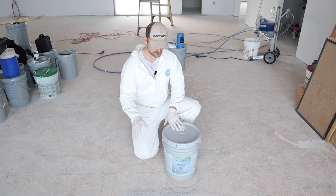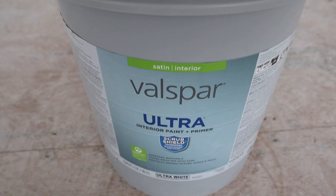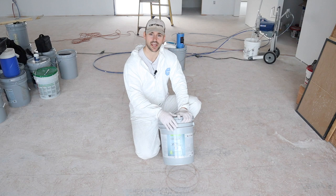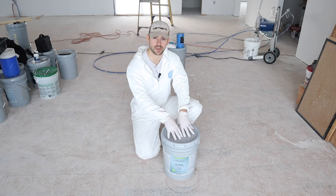I'm going to show you the paint I'll be using — this Valspar Ultra, ultra white satin interior paint. The reason I like to use satin in the garage is because it's more scrubbable than a flat paint. That's my personal preference. I also spray the ceilings and the walls the same color, so it's going to be this paint on both.